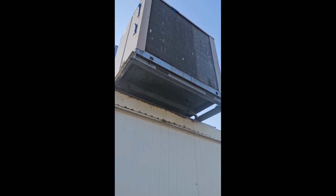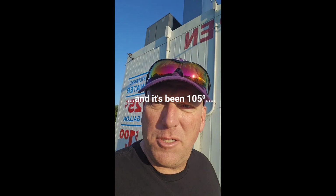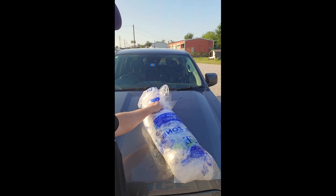Okay guys, well, we got up here and basically, long story short, it was a high pressure trip on this machine, which essentially means that those coils were probably pretty dirty, need to be cleaned out. I hadn't done them in a couple of months, which is my fault. But in all honesty, even though we're on a dirt lot, they don't get that dirty here. Now, one thing I will tell you, the glorious part of an ice machine is all the trash you get to collect. I've got all sorts of crap dumped out here.